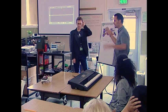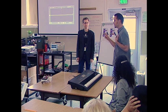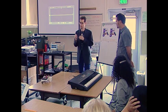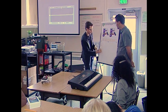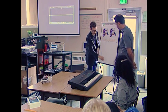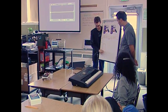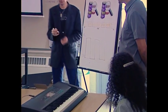Things happen so quickly — that's why we have this oscilloscope. Like a heartbeat you can hear, this signal goes so fast that we need the oscilloscope to make sure it's working right. It helps you see things you wouldn't be able to see otherwise. If we draw a graph of the voltage going to that motor — let's say it's six volts — as time goes on, we start at zero volts and suddenly jump to six volts when we turn on the motor, then drop to zero when we turn it off. It makes this repeating pattern, and we'll actually be able to see this on the screen of the scope.